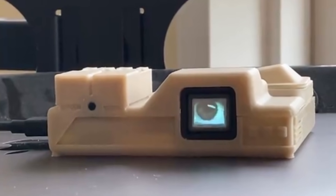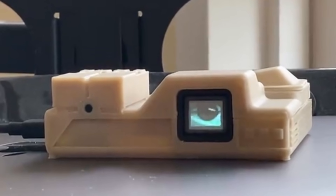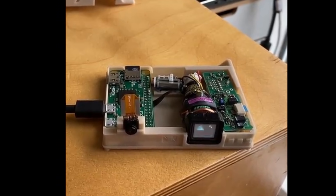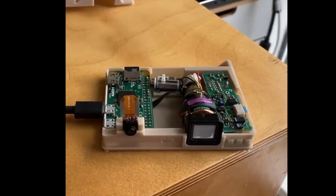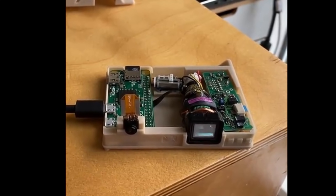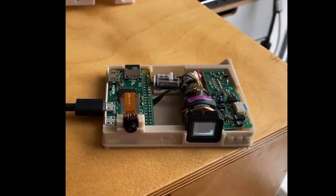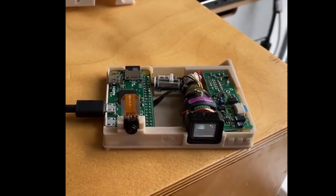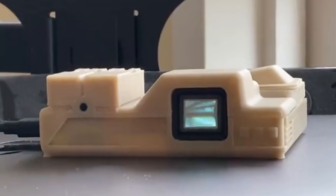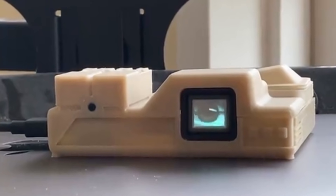On Twitter, I practically spit out my coffee after seeing this 3D-printed, pocket-sized replica of the Voigt-Kampff machine from Blade Runner. The project is from James Brown, and it's using a Raspberry Pi Zero, a Pi camera module, and a tiny CRT display pulled from an old camcorder viewfinder. For the bellows, there's a tiny linear servo that swipes back and forth. He told me that he has everything running off the Pi's 5V input, including the mini CRT and the original driver board for it. What's even crazier is that he's using OpenCV to do real-time eye tracking, which updates the screen with the cropped live image of your eye. That's a cool, creepy trick.